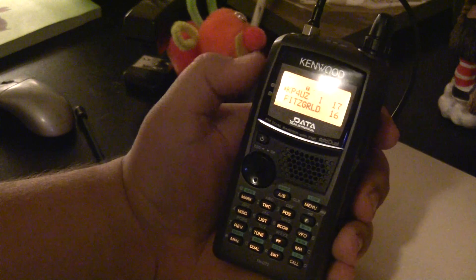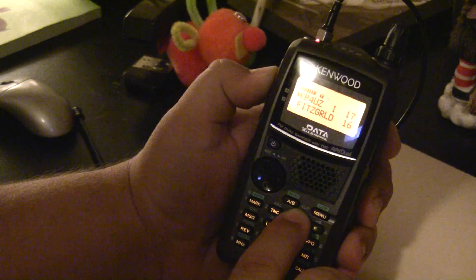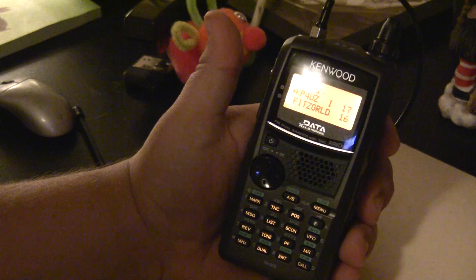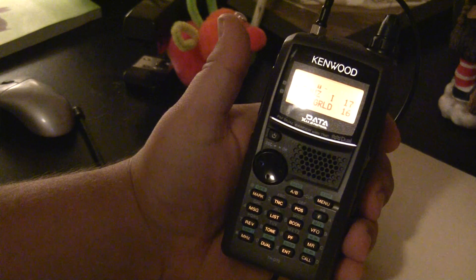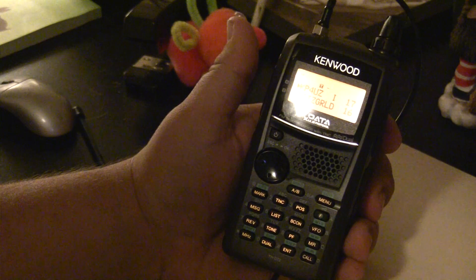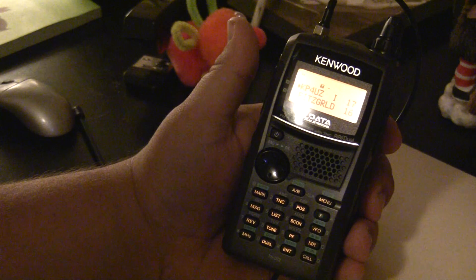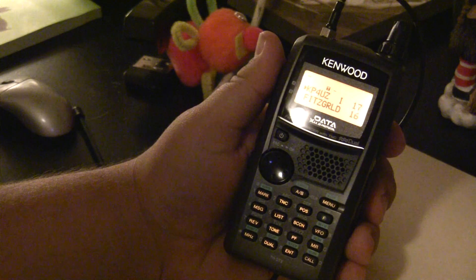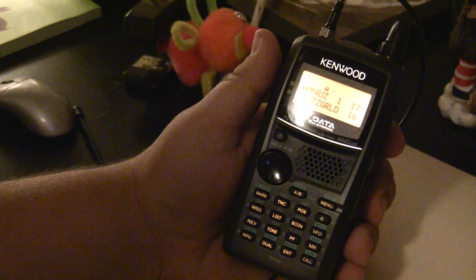I'll wait to see if I get a call back. I've already been listening for a minute and I know nobody's on it. At this point I'm going to hold the push-to-talk and press 7 and 3, then release. That will disconnect the IRLP node if it's currently hooked up to a reflector or another node that somebody forgot to turn off. Since nothing came back after pressing 73, that tells me there are no other reflectors or nodes currently connected. Now I'll type in the node number.